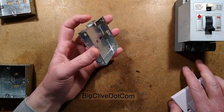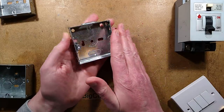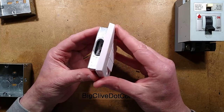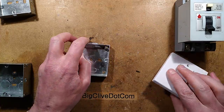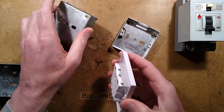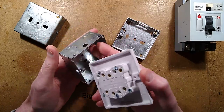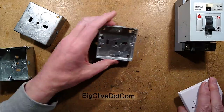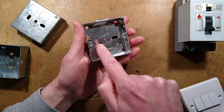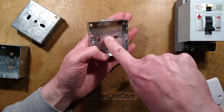The wall plate box was a lazy-builder wall box — thin enough to just cut into the plaster with minimal effort without cutting into the stonework. Even a standard switch leaves very little room in there; it's really tight. Normally I'd use a box with loads more room for wiring, especially with multi-way or modern electronic switches. But a contractor had used one of these shallow boxes, and because there was no earth terminal on the box, they had attached the earth to the back screw — basically twisted the wire around the screw.